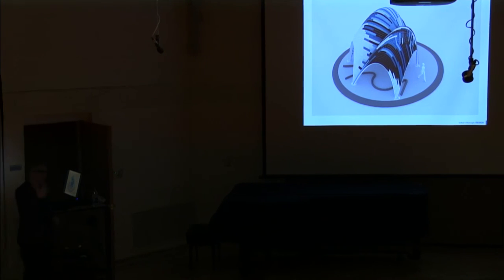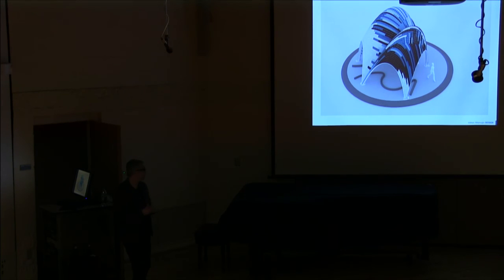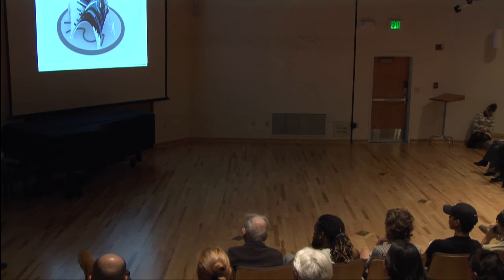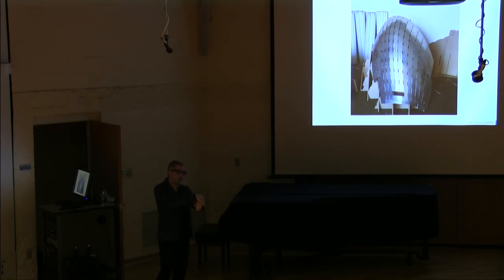It's three domes. It's also made of aluminum. And again, working with engineers and getting feedback from other professionals, we managed to create a monocoque structure. So instead of doing an arc out of metal and then cladding it with aluminum, we actually have no arc, it's just aluminum. So this thing is basically a surface structure that holds itself up. And we do that by doing a layer on the inside and a layer on the outside.